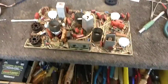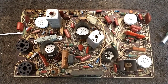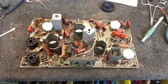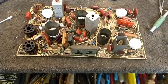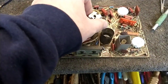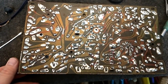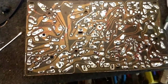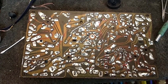All right, so we've replaced all of the out-of-tolerance resistors. And so now we've got caps, couplets, resistors. Really, the next step that I'm just going to do off-camera is I'm going to pull the pot assembly here and take the metal shield off around it and burnish it and paint it, since it has a tendency to get tin whiskers, which will migrate inside and cause all sorts of havoc. I'm also going to resolder the rest of the board, and then very carefully with the famous capacitor wizard down here, ohm out all these traces and make sure that we have excellent continuity and everything's ready to go back in.